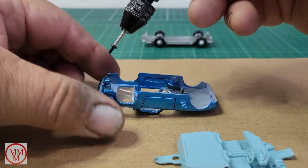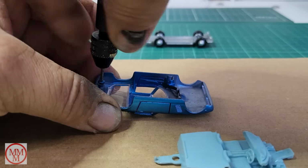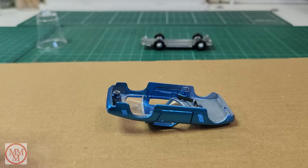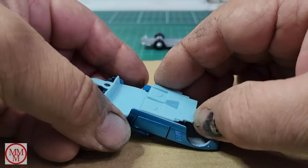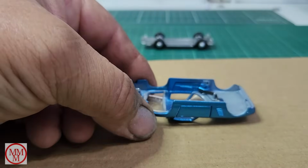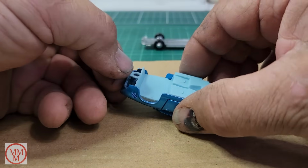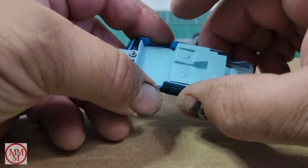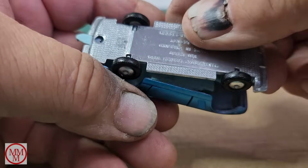Got to remember, I got a screw on the end there. I'd set myself up and then realised that I'd left a screw in there because it has to be colour matched. To match the rivet, the original rivet was colour matched, so that has to be colour matched. Trying to get this in was harder than getting it out. Does not want to go. Don't want to force it. What I had to do in the end was get a very small drill, slightly oversized than the rivet, and just open up that hole at the rear on the drawbar, just the tiniest amount to get it over that rivet. So I did that off camera.